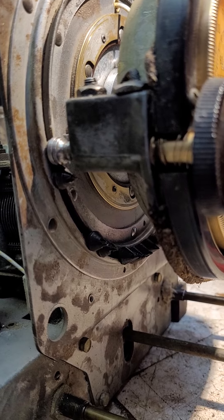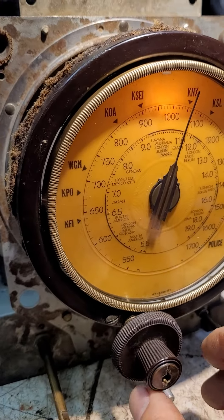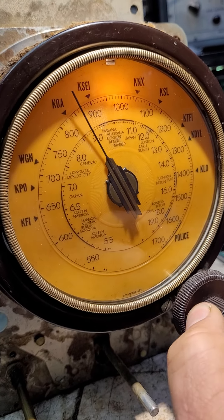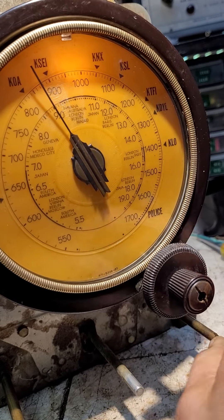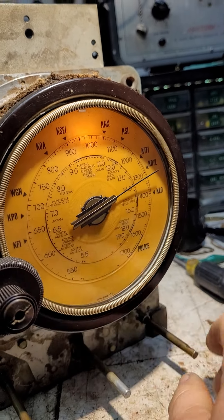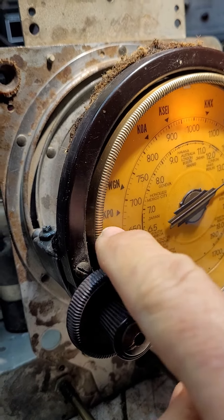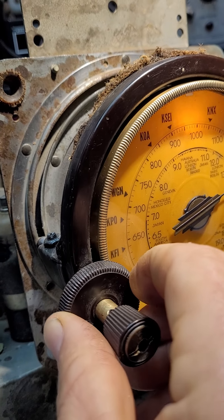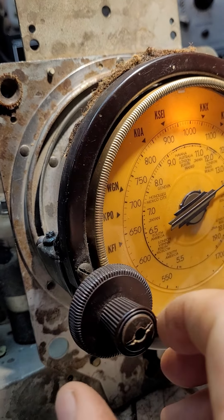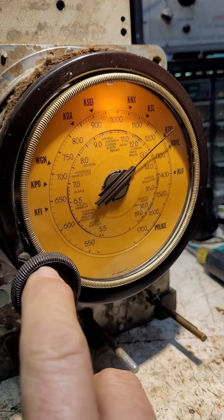And the most inward third position. The other part of this that is a little confusing — and was for me at first — is this: what is the purpose of this larger dial that is free-floating on the shaft? Its purpose is essentially a fine-tuning knob. If one comes across to a station they want to listen to, one could push this in, and just by mere friction against this corrugated ring, one could fine-tune that particular station. I'm not the greatest designer in the world, but that's how it was designed to operate.